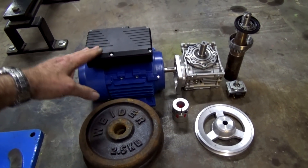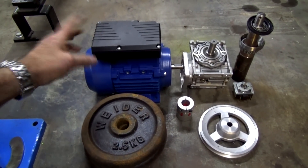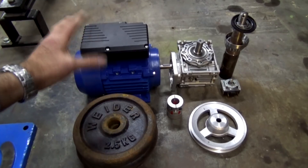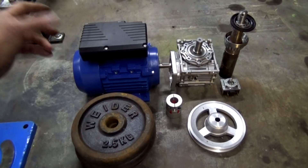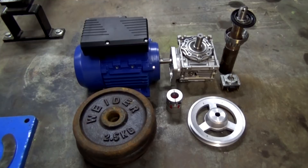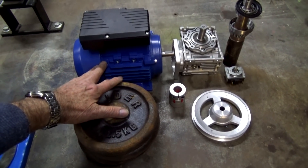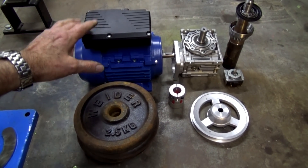Now, this is a brand new motor — I think a 300 watt motor. You might say there are enough second hand motors lying around, but the thing is that this sand muller has to be sort of semi-weatherproof. I'm going to have to keep this thing outside under an awning. It's still going to be subjected to spray and misty rain and that sort of thing, because I can't completely cover it. So I wanted a totally enclosed fan-cooled motor to stand up electrically, even though it's going to be in a sort of hostile environment.